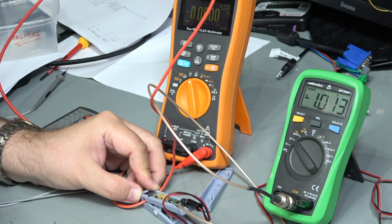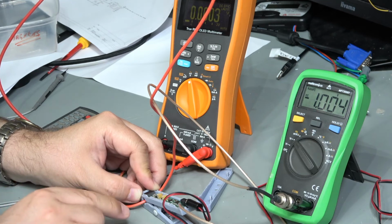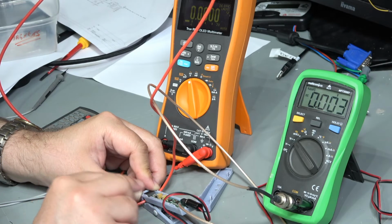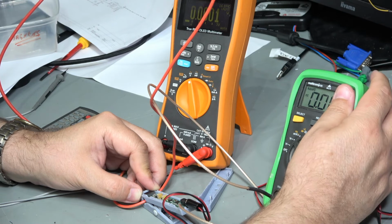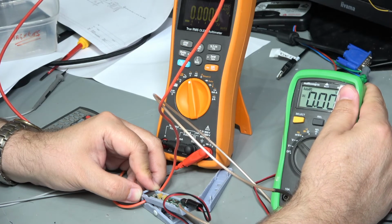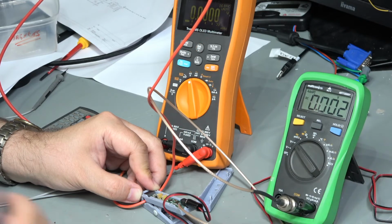So I'm pretty happy with that overall. I mean, it's a bit noisy, and it's clearly very susceptible to moving around and often has to be zeroed. I suppose the long and short of this is I'm going for 1 millivolt per milliamp, and all the commercial ones are going for 1 millivolt per 10 milliamps, which actually would mean that they're reading that. They look nice and stable and perfect. Mine has that extra digit, and that's what's causing me the problem with the noise.